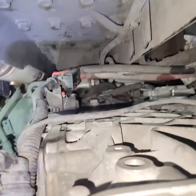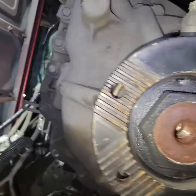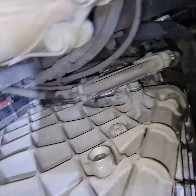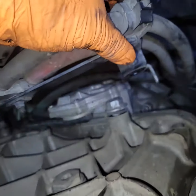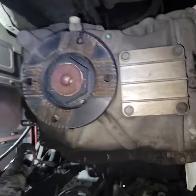Got all of our connections, electronics, back over, tucked out of the way, battery cables all off. Leaving the batteries in their clips but taking the brackets off gives you plenty of room. We're all good for bell housing — flywheel housing bolts — and we're ready to drop.